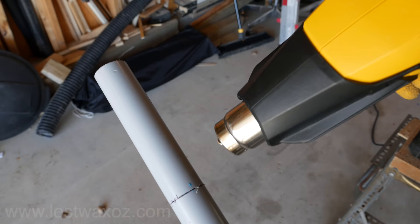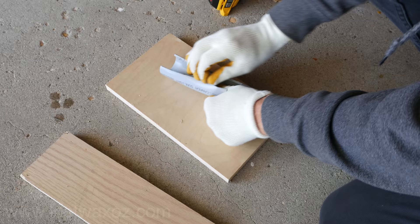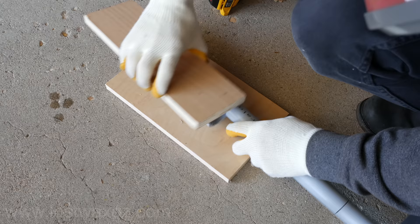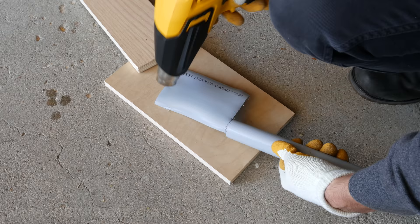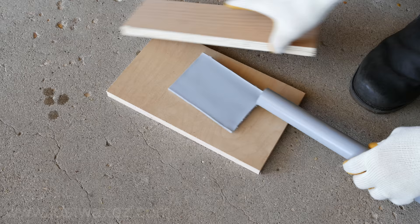The reason we're doing all this annoying cutting is because we want to transform the tubular end of that pipe into a nice big flat piece. So after lots of patient heating, when it starts to get soft, open up the tube as best you can and try to squish it between two flat boards. It can be a bit of a struggle to get that first flattenation done properly — the goal is to get the board on top nice and flat and then stand on it until it cools and hardens. You can reheat certain parts and squish them again to get it totally flat. I ended up heating mine three times before I was totally happy with it. Once you're done it should look kind of like a cleaver.